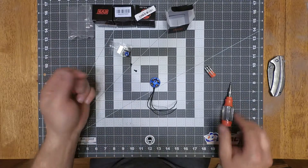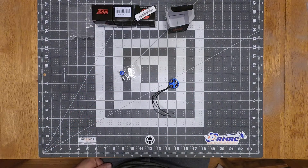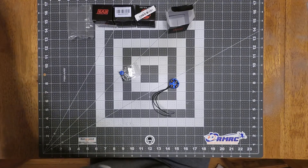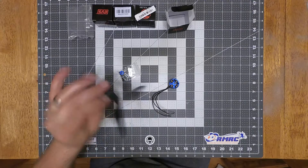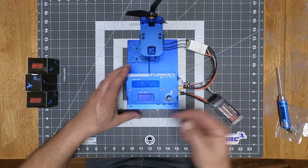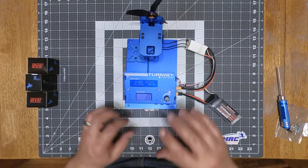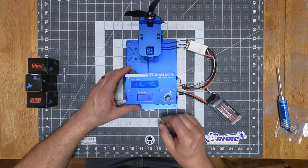I like that they all come with extra clips. I'm going to put this on the thrust bench and spin it up. The website says it puts out 1,070 grams of thrust at 29 amps, and that's with a 5045 prop. We're going to be running the 5048 tri-blade Racer Star — the same prop I run with all the other motors. I'm running a 50-amp ESC, so these will pull as much as they want. Same ESC, same battery, same prop I run with all the motors I've tested so far.